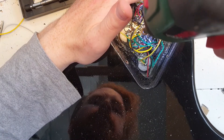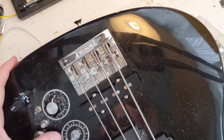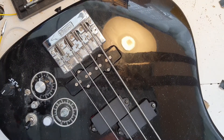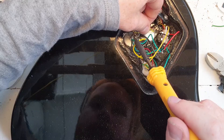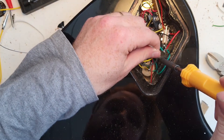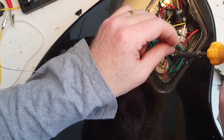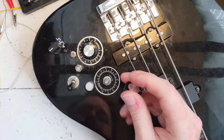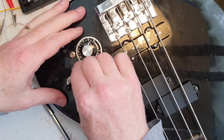Before connecting everything, I drilled one more hole for my volume control, which would go in the middle of everything. I used the same method as before, shallowing the wood with a spade drill before installing the potentiometer. After that, it was just a matter of connecting everything together. The oscillator connected to the volume pot, which then went both to ground and to the momentary toggle switch. The momentary toggle switch then connected to the output of the bass's main toggle switch. I then installed another black knob for the volume and was ready for the final test.